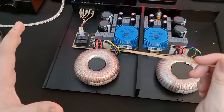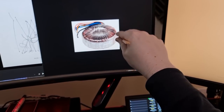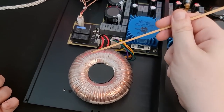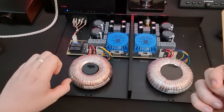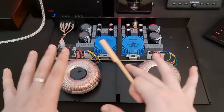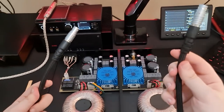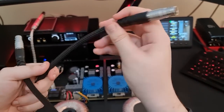These transformers are not regular toroidal transformers. A regular toroidal transformer is round with flat edges. These are O-type transformers — they are hand-wound because they cannot be made in an automated process, and they use flat wire, not round wire. Holo has done everything they can to constrain the electromagnetic field as tightly as possible. These are more expensive and more difficult to make, but they've spared no expense. All the way through to the actual cable that connects it to the DAC — this is the interlink cable, pretty thick but flexible as well.